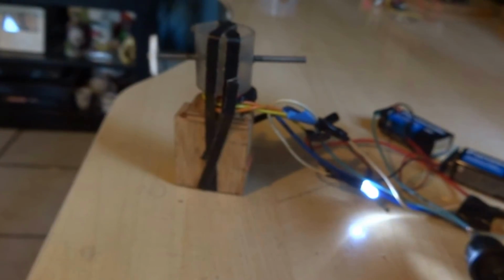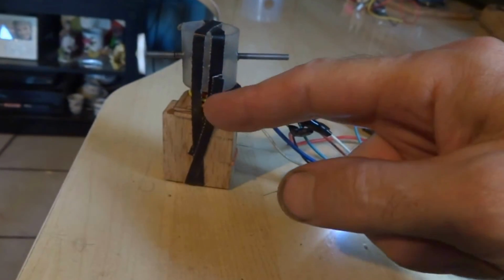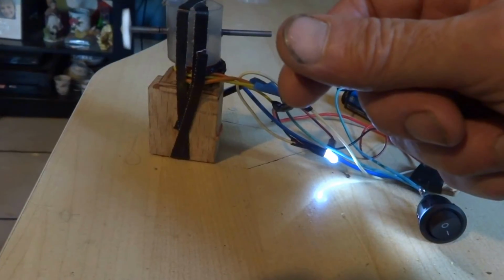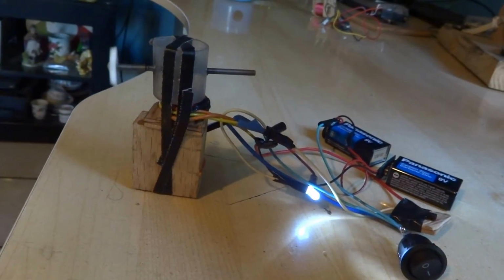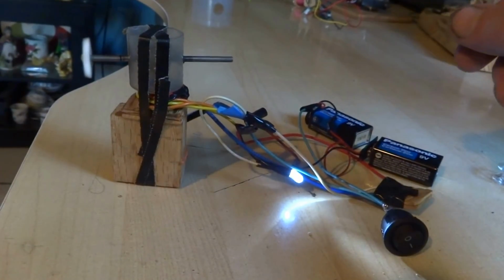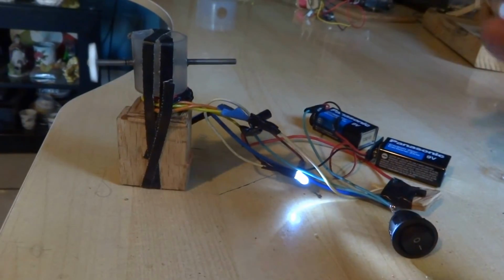So I just want to show that, oh, by the way, this is 32 gauge wire underneath these lead wires I put underneath there. So a bifilar wound 32 gauge wire on that tiny little bobbin, and it does work. Again, I had to go up to 18 volts to get it to halfway work good. Not the best design, but it's working.